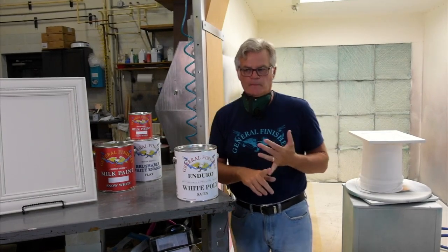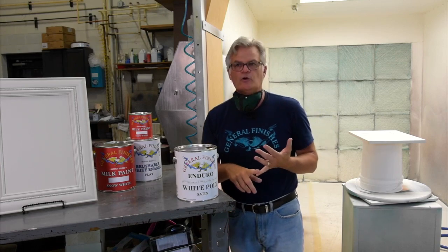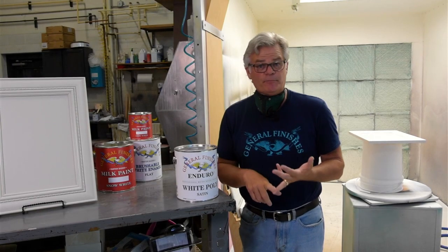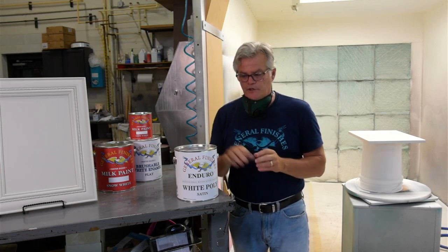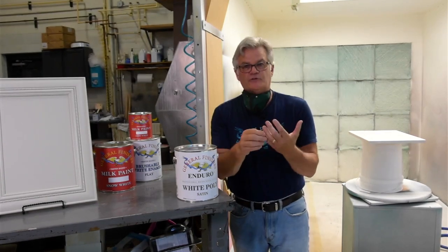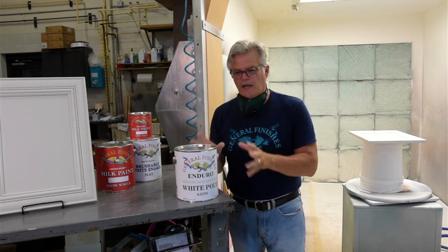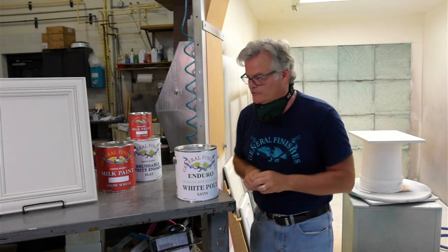I had a customer call this morning. It was a perfect example, just before we went on camera. Went into a home that was built 15 years ago, originally had an oil-based paint on it. A crew came in and they used a very high quality bonding primer over the oil base, then put on a high quality latex paint, which started to bubble and peel because of the system, and then tried to come in and fix it, so he was going to use our white poly. So we just had to coach him through the point that you've got 4 different manufacturers' products down. You need to prep and prime properly and let that dry before you move on to the pigmented white poly. So it's a great cabinet quality product, but again, understand what you're building and understand what you're using when it comes to other manufacturers' products compatibility.